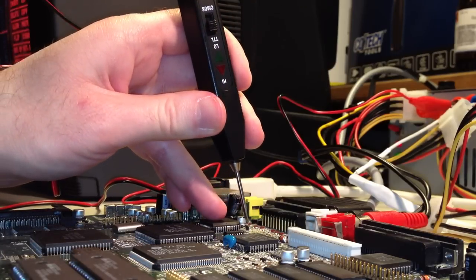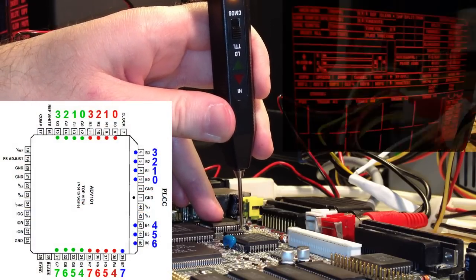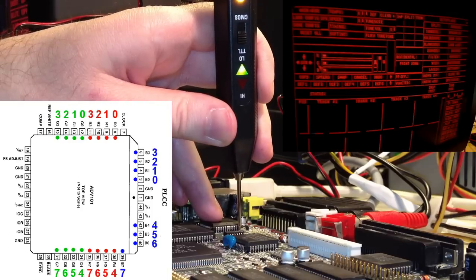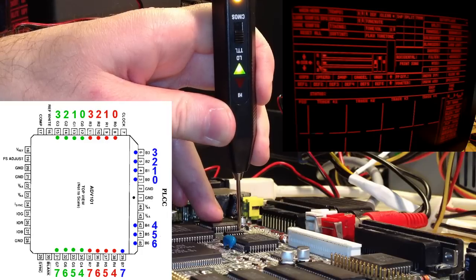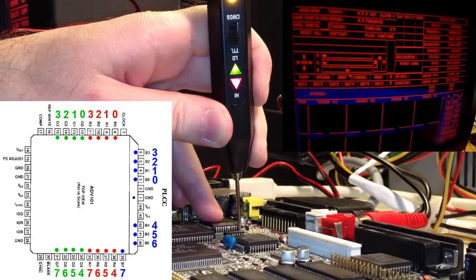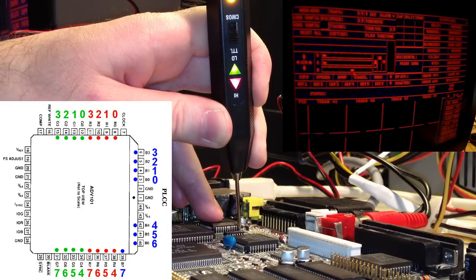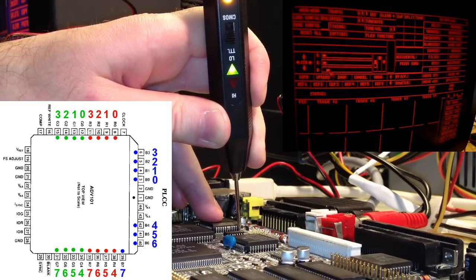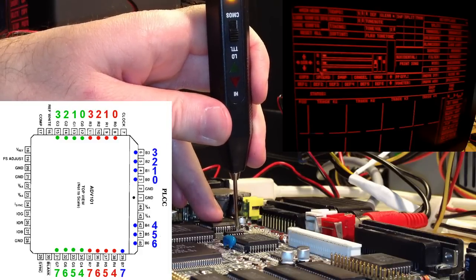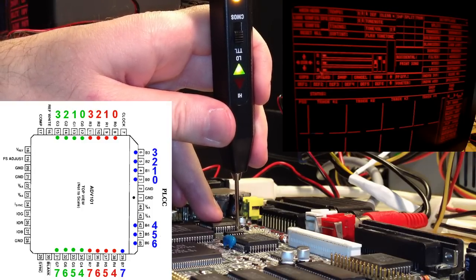So if I probe one of the pins here, this would be the pin for blue 3, B3. And okay, we can see here that we have a low level there. It's indicating that. Now if I move the slide bar here in ProTracker, as we cross the midsection, it's switching. So here, the data bit is active. And here it's inactive. So let me probe the next one here. So this would be blue 2. B2. Right there.